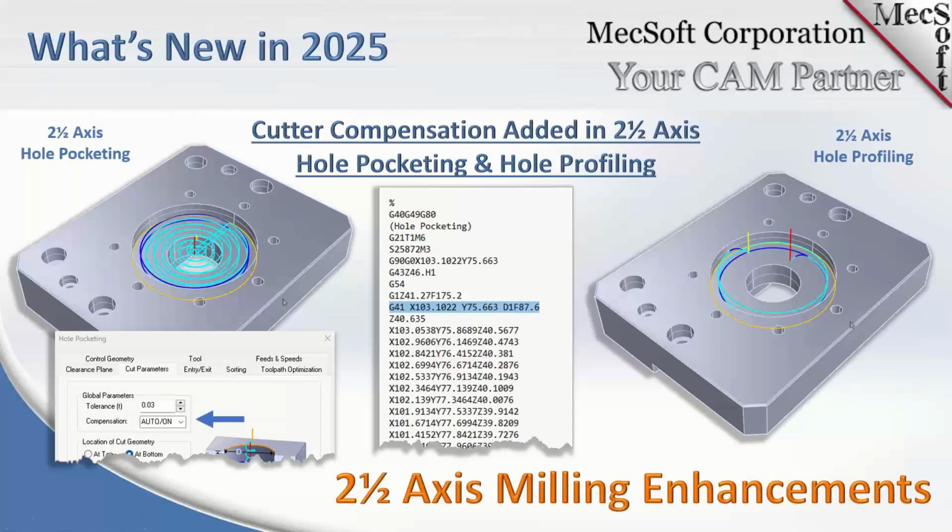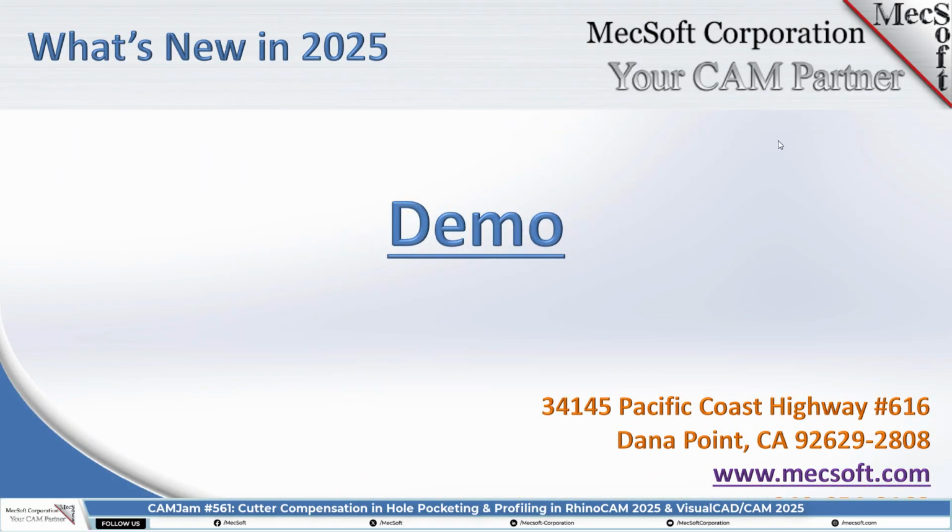When you post, I do want to make a mention of the post for cutter comp. Cutter comp does have to be set up in your post in order to output the G40, G41, G42, etc. in your G code file. So if you're posting and you're looking for it and you don't see it, just contact us or send us your post definition file, and we'll add those criteria to it and send it back to you.